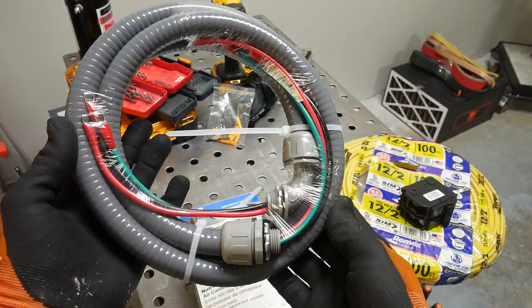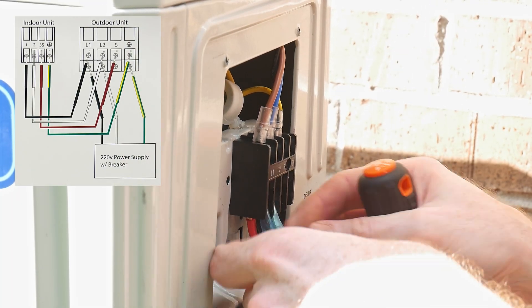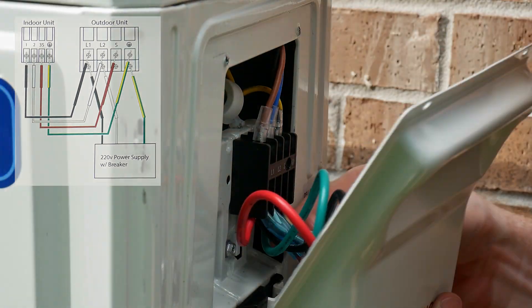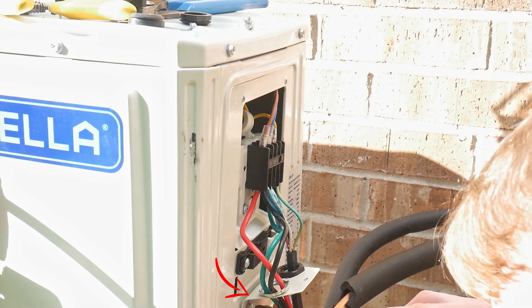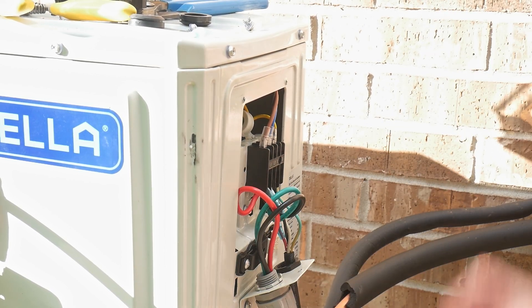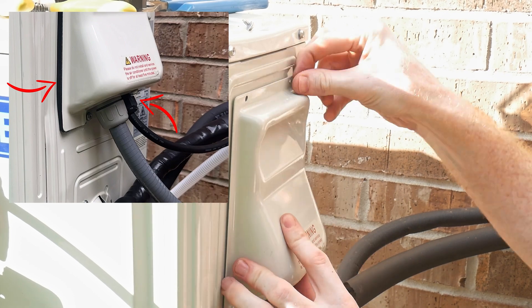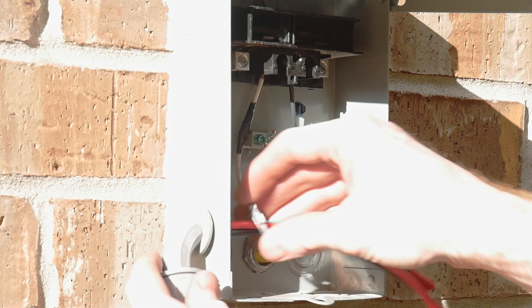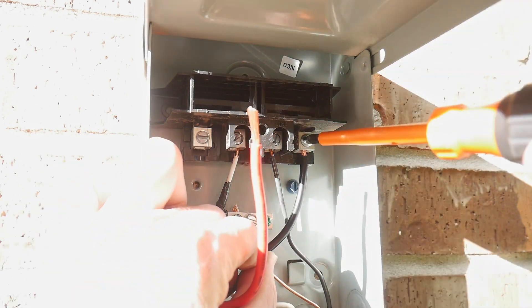While the vacuum pump was running, I continued with the wiring. I ordered a pre-made 10-gauge whip for this install — a mistake, since it was very difficult to get the 10 AWG stranded copper into the mini-split connection ports. I would have been better off making my own line set with 14 or 12-gauge THWN wire. There is a little holder for the cable glands that should be affixed to the unit before the cover, allowing you to get the wires in the right orientation. On the 60-amp disconnect, all you need to do is knock out a spot, screw in a connector on the whip's 90-degree cable gland, and install the black and red load wires on the outside of the connection block.